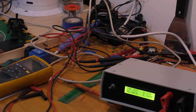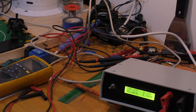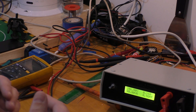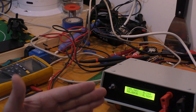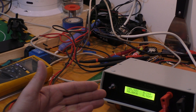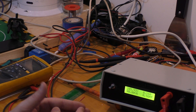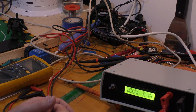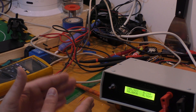I've cheated and used a Variac. But if you're just using straight mains supply and passing a calibration globe through it, you need to take into account the difference in voltage from what the appliance is supposed to run at to what it is running at. That globe told me it's between 240 to 250 volts at 40 watts. So I equals P over V - the current equals the power divided by the voltage - that would equal 0.17 amps. I've got 0.16 in here. If you follow that same method I showed you with the voltage, you can do that with the current - that's how you set your current.